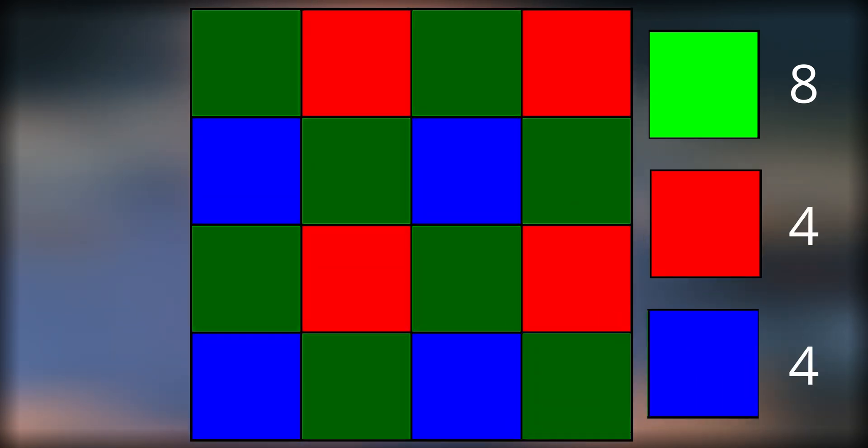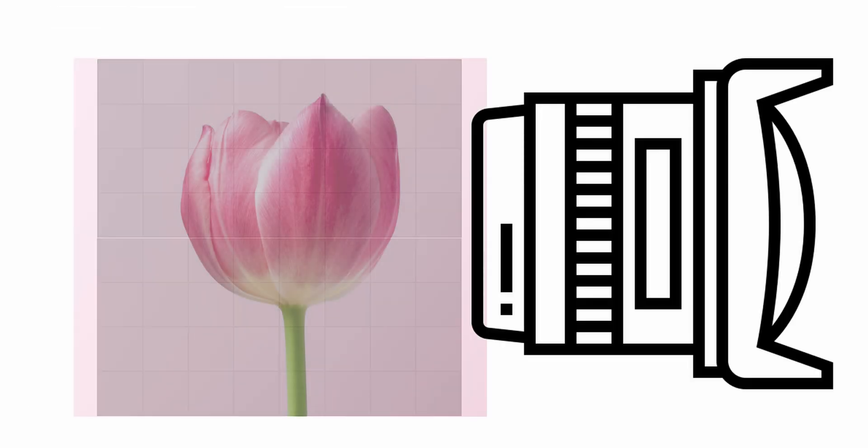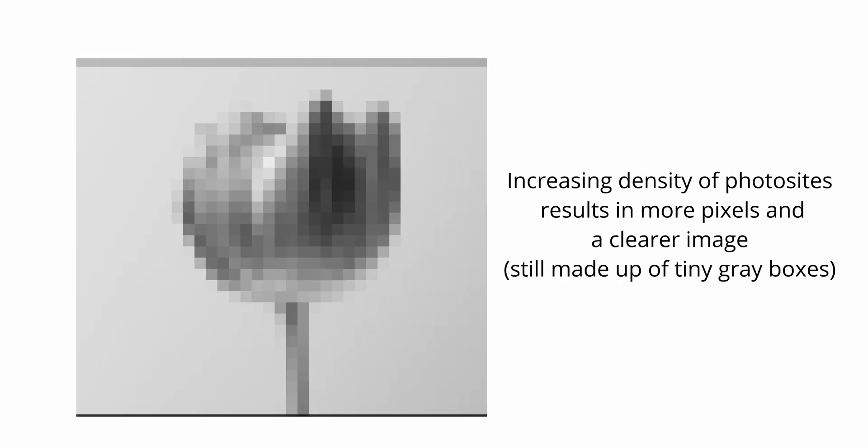If that quote means nothing to you, it's time to get technical. In the past, Blackmagic used the famous Bayer pattern in their sensors — in fact, most digital cameras use this pattern. It is one of the reasons green screens became popular when cinema went digital. There are twice as many green light receptors in this type of sensor than there are blue or red, making for a cleaner green channel key. Digital camera sensors are made up of photosites — small tiny sensors that can measure light intensity, and that's it. Thousands of these sensors on a plane, combined with the projection of a lens, result in our ability to record black and white images made up of tiny dots or pixels.